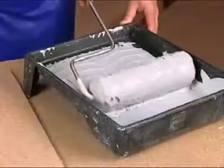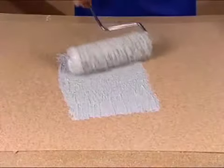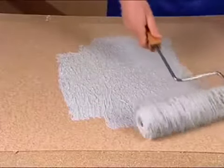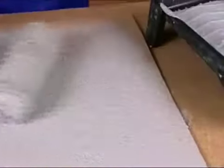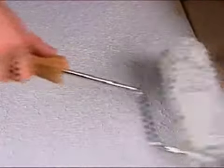Now let's do a second coat to create a more uniform stone-like texture. Nothing could be simpler. Just add a second coat of hard rock in the same color or in a different color, just as you did the first coat. All you do is roll in your preferred color in random directions using light roller pressure. Then pass the roller over the surface for final texturing and color blend. Since this finish is more solidly covered by hard rock, only one coat of primer is required beforehand.